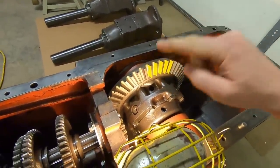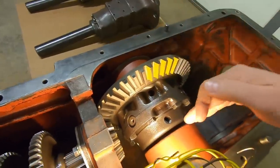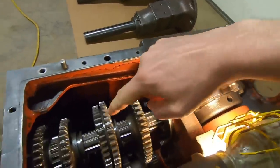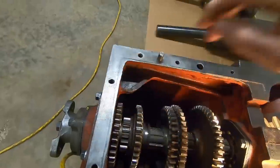And I'll explain it one more time, because this always trips people up that are not used to setting gear sets that are on ball bearing mountings. Ball bearing right here, ball bearing right there. That's deflection. Ball bearing here, more deflection. The roller bearing between the sliding shaft and the input, lots of deflection. Two ball bearings on the input, more deflection still.